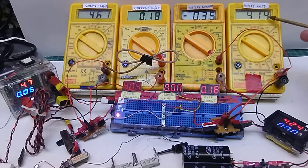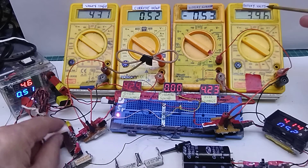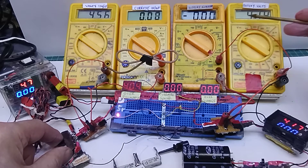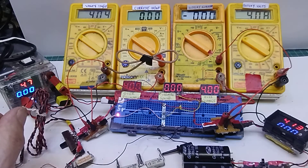When the overcharge voltage is reached, the overcharge current pin should go to zero and switch off the FET. We've got to about 4.2 volts and we can see a problem: as shown on the datasheet, it cycles very quickly between trying to charge and discharge, so the FETs are going on and off quite quickly. Maybe it will settle, but I can't see why it should. Putting a load on and trying again - on my meters it gets to about 4.12V and once again it's cycling above and below the voltage. Most peculiar, but that is what's happening.